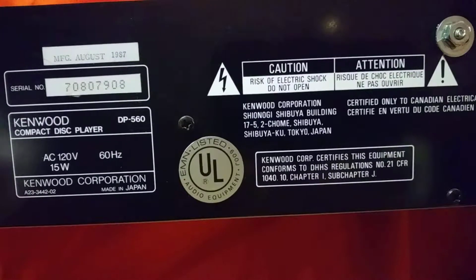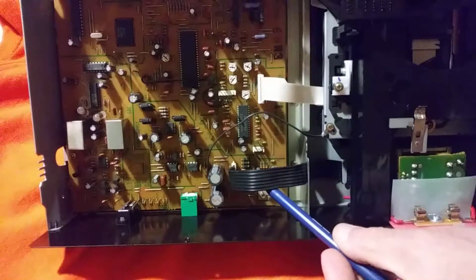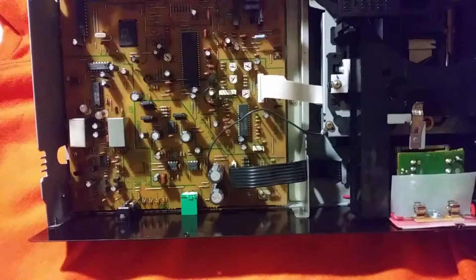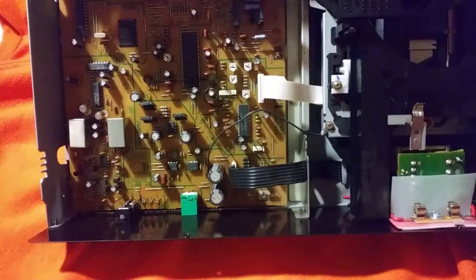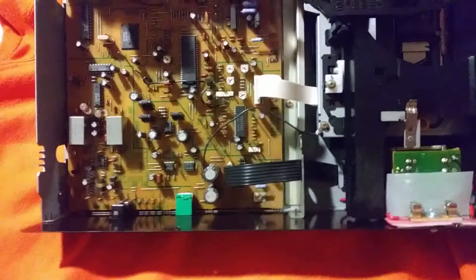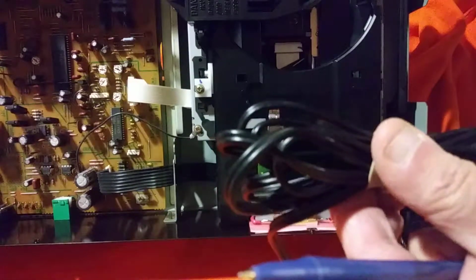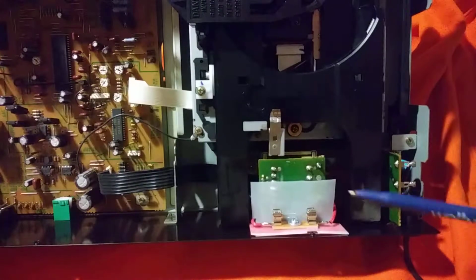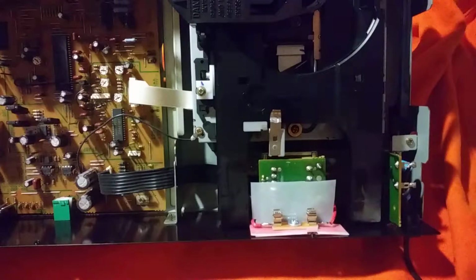So if something goes wrong with it, such as these diodes under here going bad, if they short, it can overheat this transformer in here, and if the transformer shorts out, it will blow this fuse before the power cord gets warm and possibly shorts out and starts a fire. So that's why I put a very small fuse on the primary of the AC.